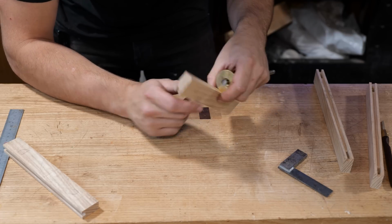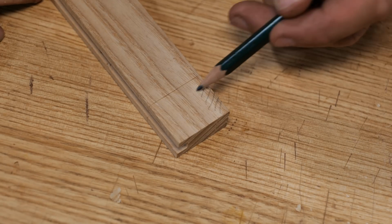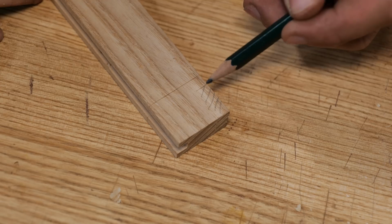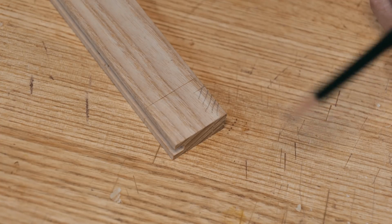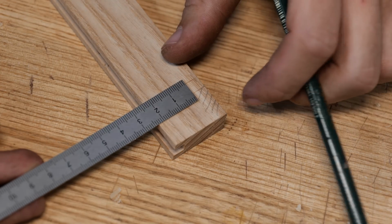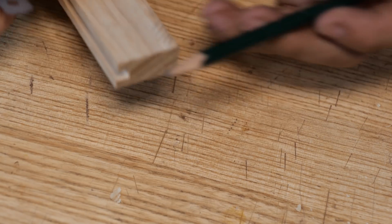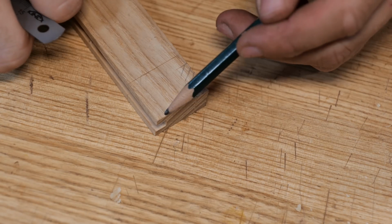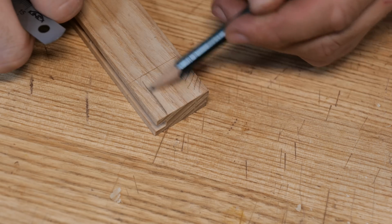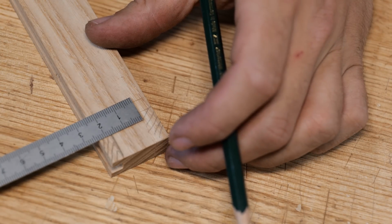So there you go, I've drawn the side profile on this one just so you can see kind of what you're going for. So 7mm down, that was 6mm across, so that's the depth of the haunch. And then I think we said the overall size of the tenon, top to bottom, was 17mm, and obviously if you measure that, that is now 23. But by the time you cut off these cheeks and that groove underneath is exposed, that will then drop in 6mm. This will all become waste, and then you'll be left with a 17mm tenon.